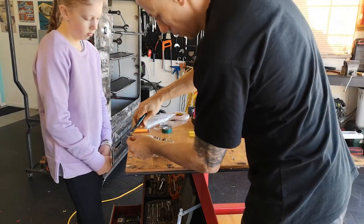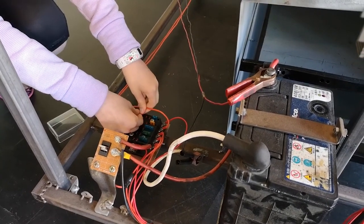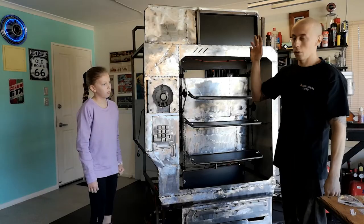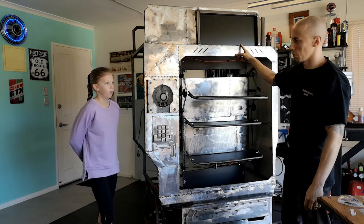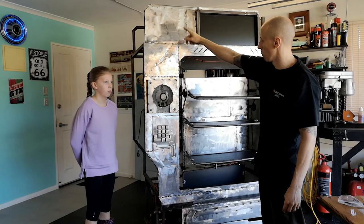Okay, so that's our negative terminal — nice, so in the center. Currently the actual screen is running off a power adapter because the battery doesn't seem to be enough to run the 14 volts required — it's not quite 14 and not close enough. But the Raspberry Pi is just behind this panel, fired up off a cigarette lighter adapter I've chopped up and soldered onto that. We haven't actually tested it, so this is going to be the very first time we run the Pi off the adapter into this.